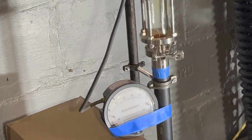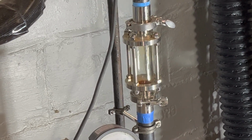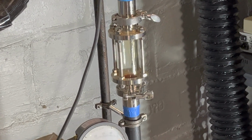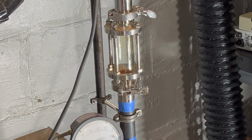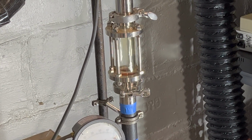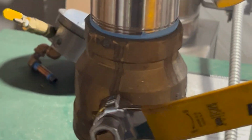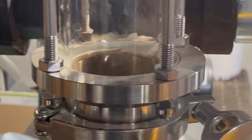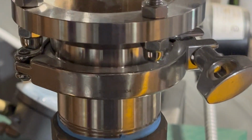Watch as I start to close the valve that provides steam to the main, right? Which is what I'm calling the equalizer now. The main is the equalizer. I start to close it, I close it, I close it. Look at there. I've got it cracked right now. I got it right here. And look, you can see weird stuff is happening. Weird stuff is happening. I don't know if it's a pressure situation that's causing this.